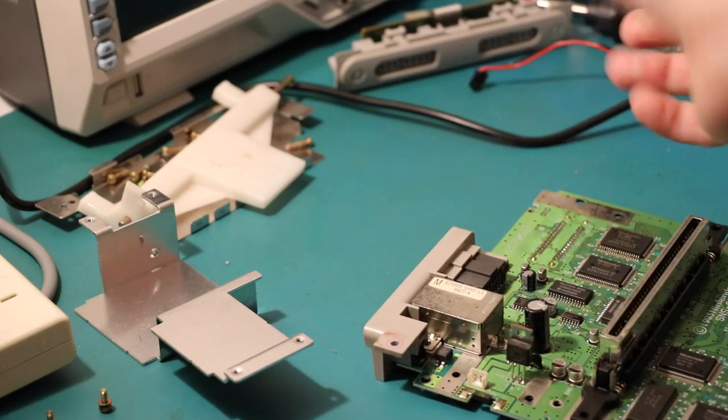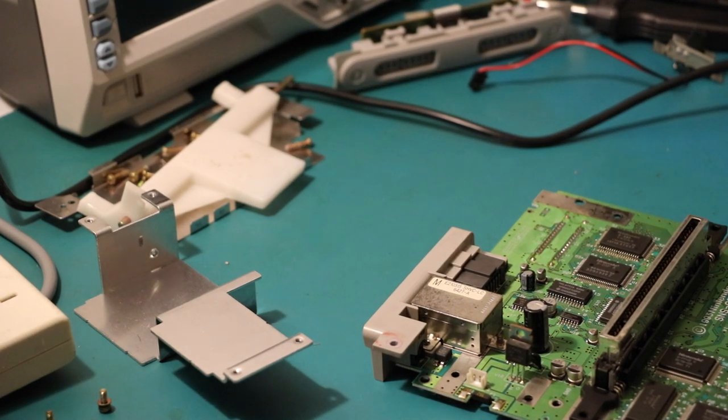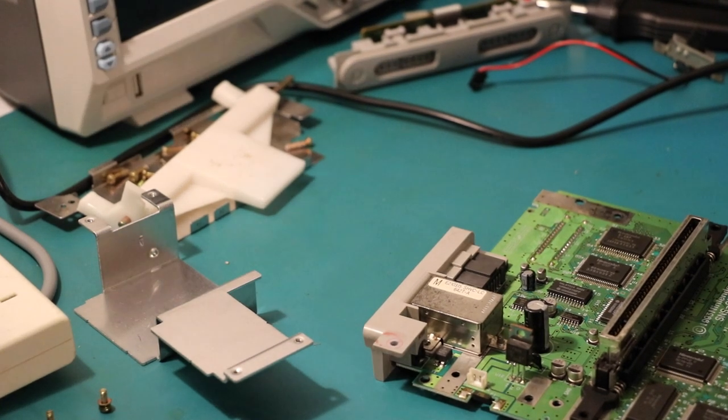But let's see, the replacements I've got, there's some nice ST Microelectronics ones. Hopefully they're not fake. So what do we get? L7805CV. And they were manufactured first quarter of 2015 by the looks. These are rated at 1.5 amps. So they're more than sufficient for the SNES, which runs at, I think, 1.3 maximum. At least this particular model.